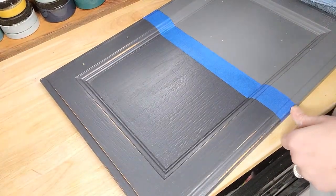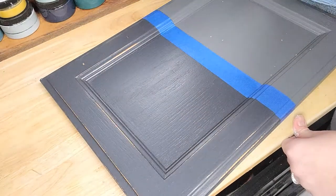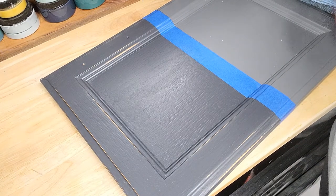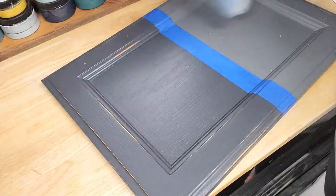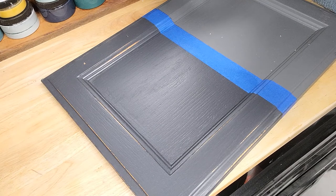So once again — furniture tonic: brush it on, use a fine grit sandpaper if you just want a soft finish, distress it with some heavier grit if you want, then use a microfiber cloth to wipe back the excess tonic. You'll have a beautifully distressed piece that has been sealed and distressed all in one step, and you can walk away and let it cure. Thanks for watching and happy painting!